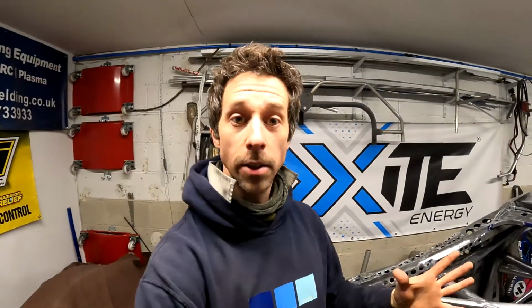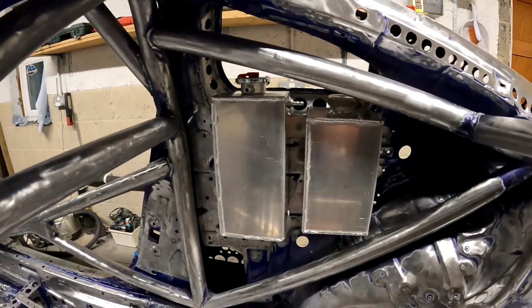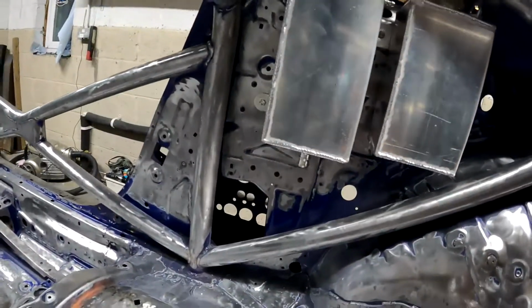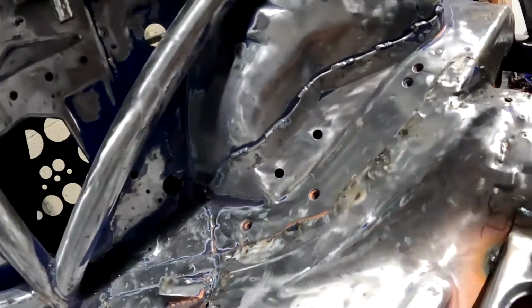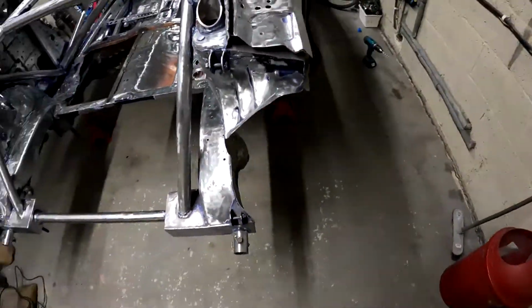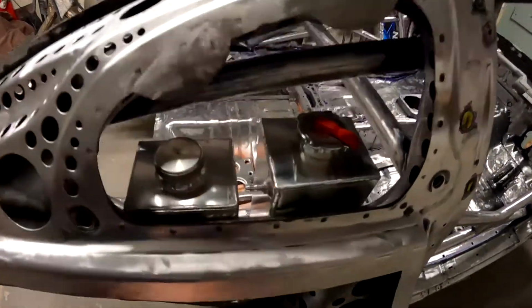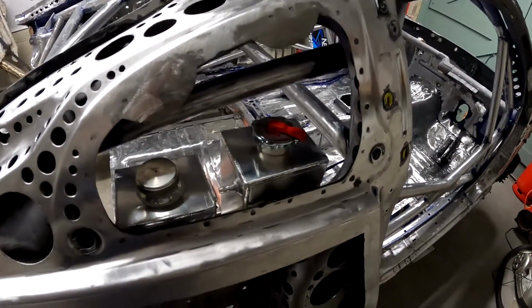Okay, so I'm now back in the garage again with the LSZ, and we have the two header tanks mounted in position. So yeah, radiator recovery tank and then supercharger header tank. So yeah, if I try and get down underneath here, you should then see the makeup line. So the line can come up from down here, go up and join it under there, breather at the top, then both of these little 6mm, 7mm lines will come down through here and then to the point onto the actual radiators themselves. Also welded in these little tabs up here, so the new window can go on there, and then as you can see, yeah, both are nice, easily serviceable, similar to what I've done with the fuel tank. So yeah, pretty chuffed with how that's come out.